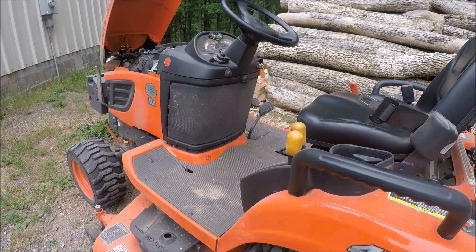Now I'm going to let the deck down so I can remove these guards to clean the deck off quickly. Watch when you remove it because there are two washers on it. Here's what the deck looks like with the guards off — there's some grass, and usually it's packed pretty bad in here. This side's got a bunch of grass on it. I like to remove the grass because I feel like it'll hold moisture and maybe make the deck rust up quicker.